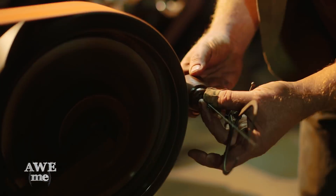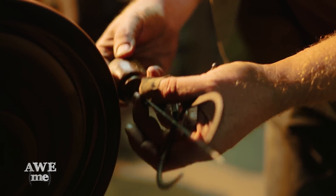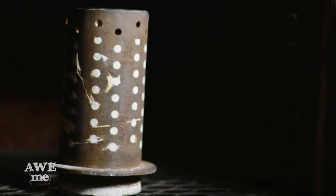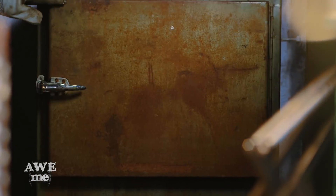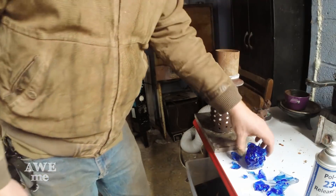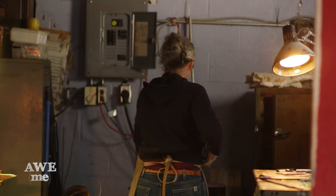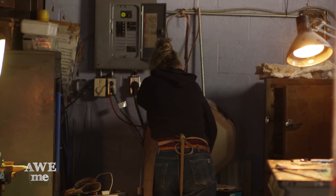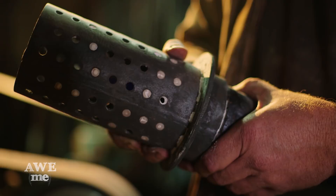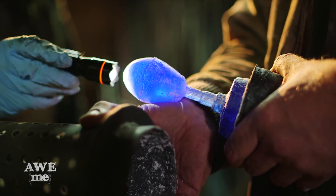Lauren provided me with a large egg shape. It's not quite the form that I want to be able to mount the glass. I'm just going to go ahead and take it right to the sander. Before going to the kiln, we'll often go to a small oven and that will allow us to de-wax the unit so that we don't have to burn all of the wax out inside of the kiln. After the flask has come back down closer to room temperature, I load the glass in the top. This will have to slump down inside. We'll move the flasks into the kiln where they'll go up to 1,350 degrees Fahrenheit. After almost two days in the kiln, we can remove the flask and show the glass.